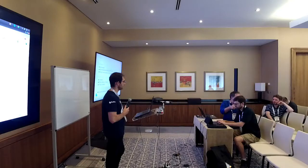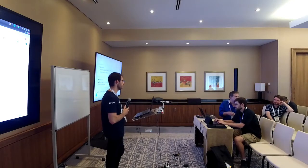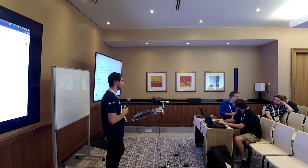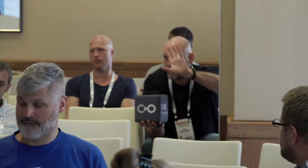Like, if all it is is an interrupt, then for every single device all it needs extra is an interrupt. And then you get into some things like the SPI displays that take like five different parameters. But those are not the norm, right? Usually it's just I need a reset line, I need an interrupt, and you don't have to have that many different. No, and if we steal from device tree overlay, I have no problem with that. It's the same idea, right? Let's do the same thing. We can, and if we ever get real device tree overlay, we can merge into that eventually. But if we put it in the spec in a backwardly compatible way, we should be fine.